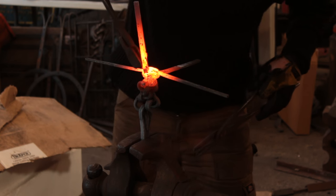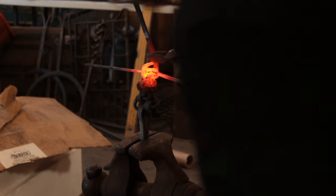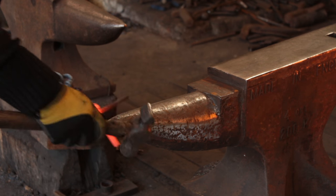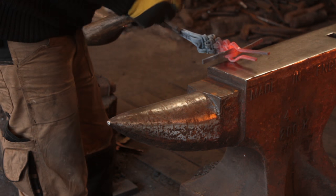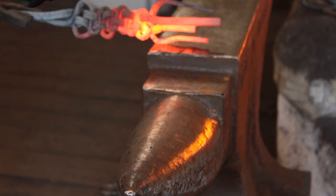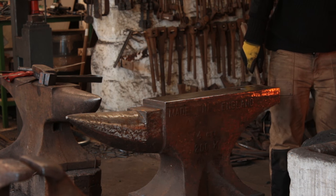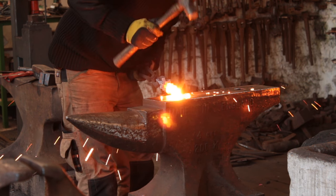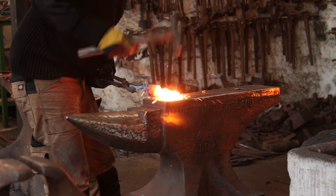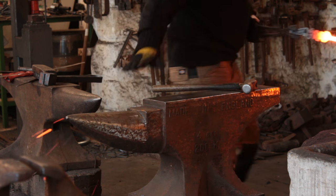I'll just lay it straight down on the fire to heat up all the bars at the same time and go from there. Once your braid has reached the length you want or you've run out of material, just take the ends and push them together ready to forge weld. I'm not wellying the iron to weld it — just tapping it together — because wrought iron forges out quite easily compared to mild steel. If you hit it too hard it will stretch and flatten far more than you'd expect, so keep an eye on that.